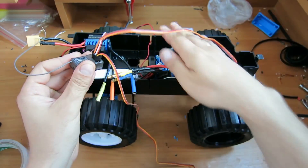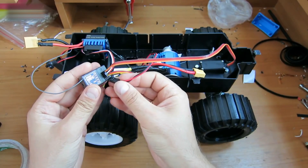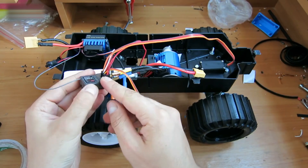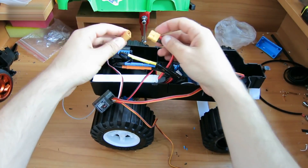Connect the motor cooling fan power wire like this — the speed controller isn't here, just the two wires: positive and negative. Connect the motor to the speed controller and then the power for the controller.